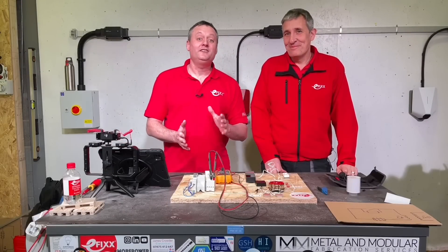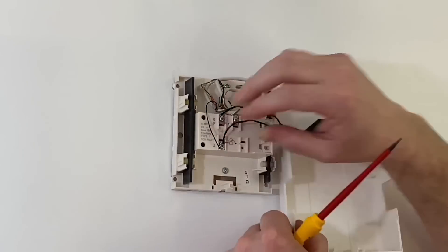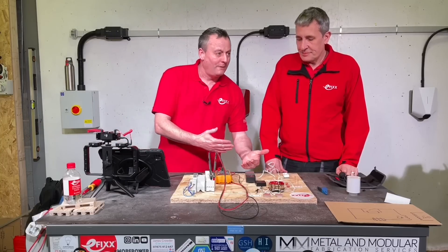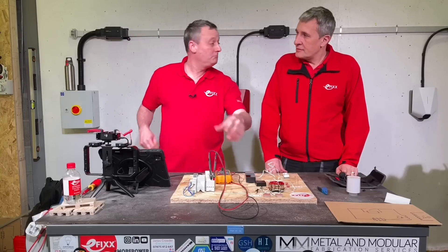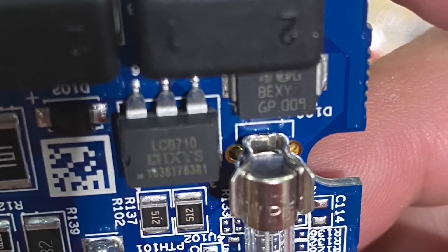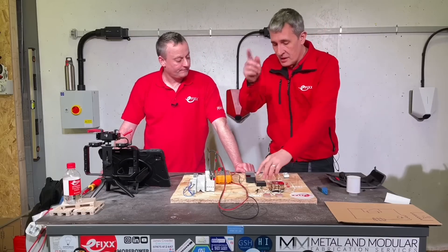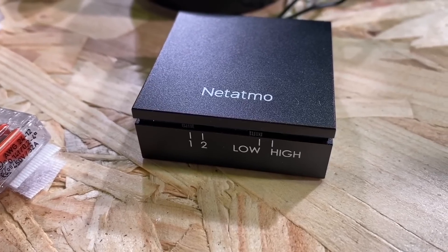So like with any good lesson, in order that learning has occurred, I've got to explain what happened then. The chime module is connected across the bell, and it's sometimes in circuit and sometimes out of circuit. When it's connected it's actually bypassing the bell and taking the electrical energy to charge the smart doorbell. When I press the smart doorbell button, I want the power to actually energize the chime mechanism — so in that case it switches itself out of circuit, allowing the bell to ring. Yeah, and we had a look inside this before we made the video to find out ourselves what's going on in there. Essentially what you've got in there is a solid state relay that does that switching process, plus a lot of electronics to understand when to switch the relay out of circuit and when to bring it back in. We've set it on the default mode that Netatmo recommends; there are some other modes depending on different bell configurations you may have in circuit.